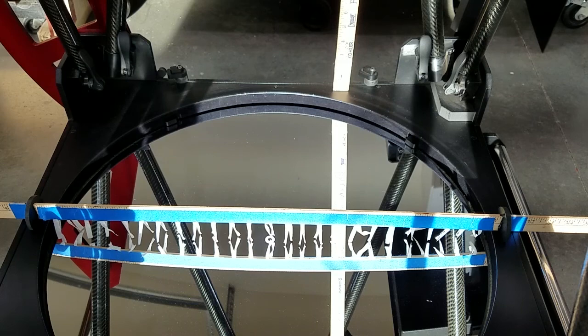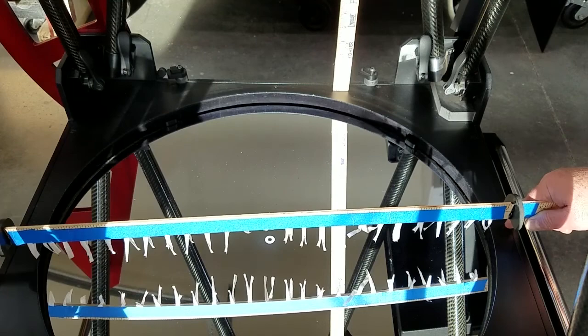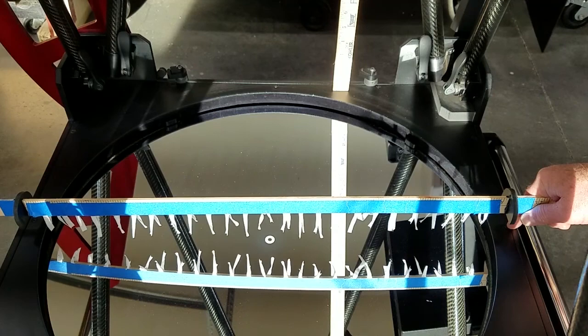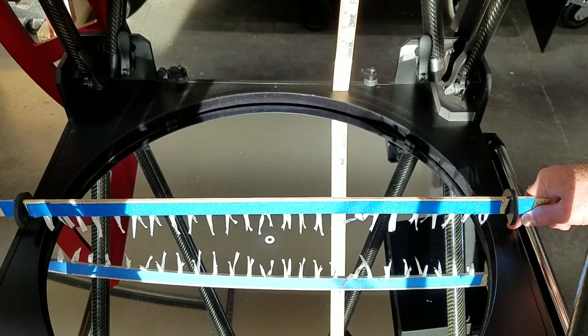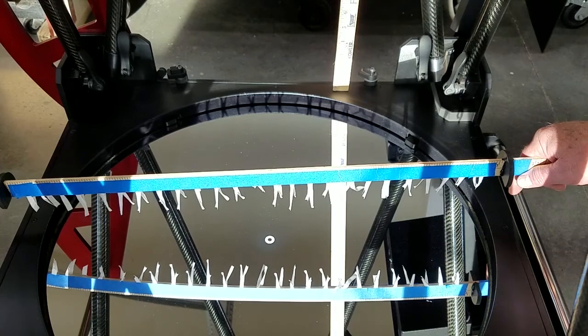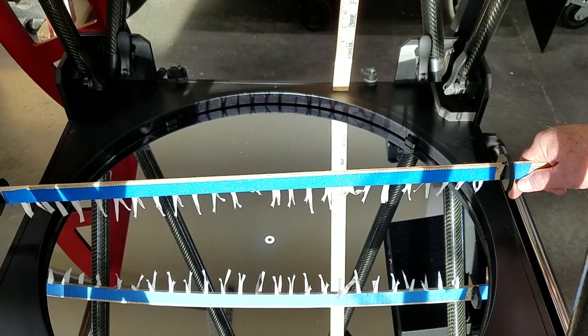Relocating the telltales to better visualize the shape of the flow from the nozzle and the area immediately above the mirror. At about two inches above the glass, the telltales near the edge are not doing anything, but the central region is quite active. About one-third of the way in, the telltales start to move, showing the area of transitional Reynolds flow. At about four inches above the surface, the taper has continued and we now have a strong central region.